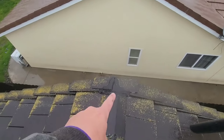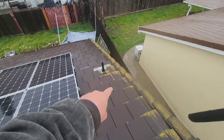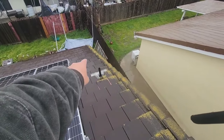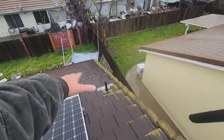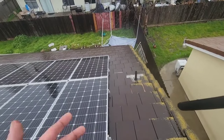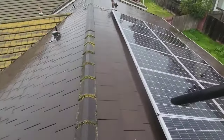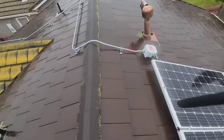There's a chipped tile — this backside has quite a bit of chipped and cracked tiles, as well as the peak transition, which also needs some lead flashing. This is showing lots of holes and there are damaged tiles here, which is what's causing the kitchen leak. This all looks bad. So the kitchen leak is being caused by this area. I'd want to peel up all these tiles, maybe all the way down to the bottom of the solar panels, remove the bad batten boards, remove the bad underlayment, and inspect the wood for any rot.